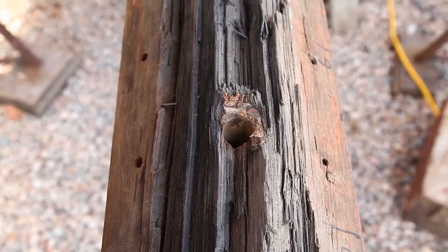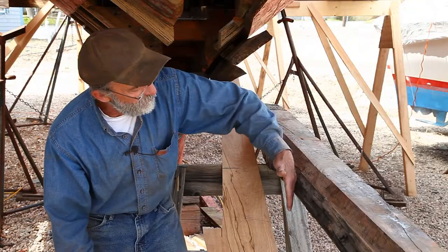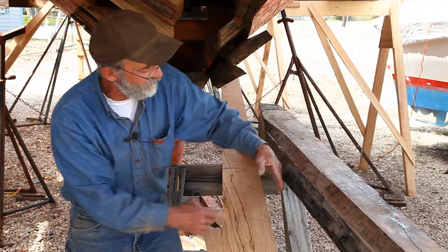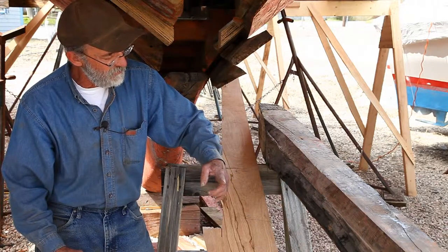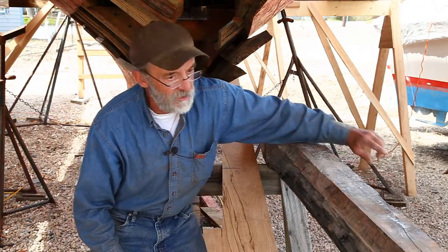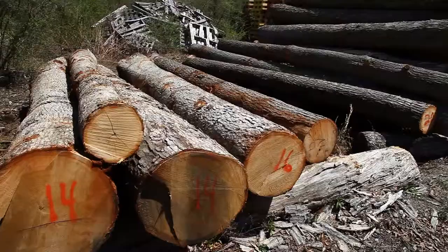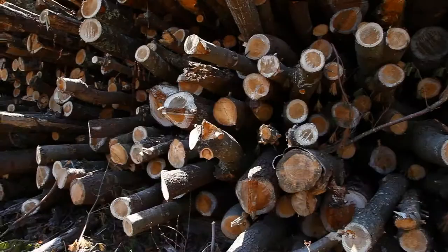The timber seems to have stayed pretty stable, but we want the annual rings to go right directly through it this way and the medullary rays in this direction. We're going to have the center of the tree when we cut it out either on this side of the timber, directly in line with the bolt holes, or on the other side — it depends on the curvature and how it looks when we roll the log over. So we're off to the sawmill now to get that log up on the mill and see what we get out of it.